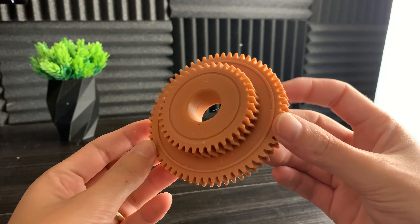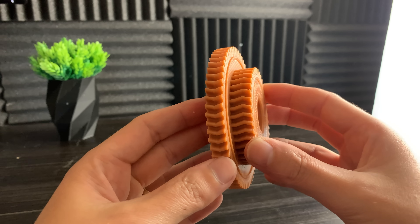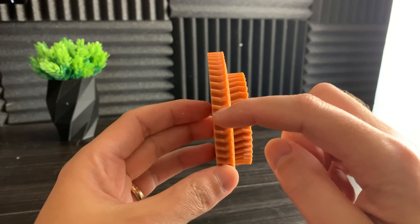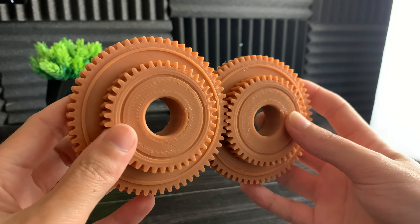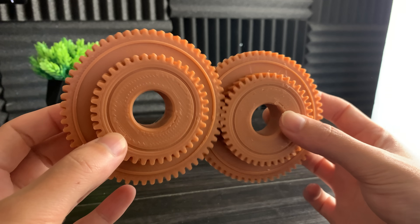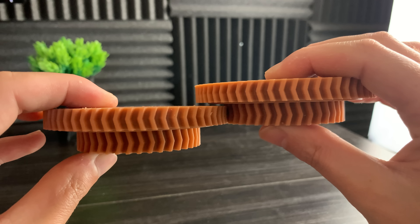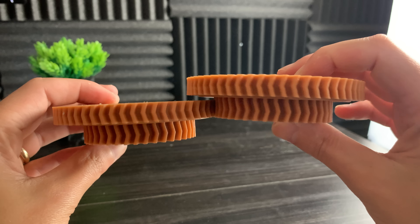First, let's take a look at the gear's design. This is a compound double helical gear. The teeth have a chevron shape and two individual gears will interface like so. The gear ratio of these two gears is only 1.5 to 1. By using the double helical gears, the gears should align better and they should run smoother and handle more torque.